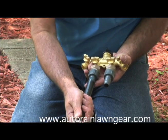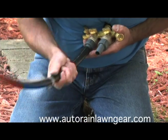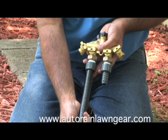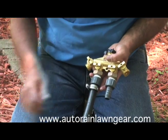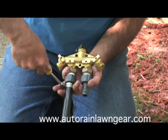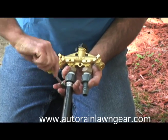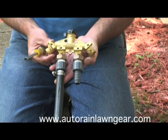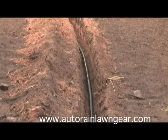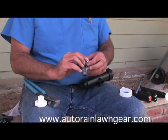Cut the poly pipe to the length needed to be in the trench previously dug. This length should be about 4 to 5 inches below the surface. Place hose clamp over poly pipe, soap the barbed elbow fitting, and assemble. Place clamp over the end of the poly pipe, which will continue on to the sprinkler heads. Soap the other end of the barbed elbow, assemble, and clamp. Now you can run the poly pipe out along the trench you have dug.